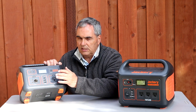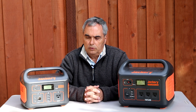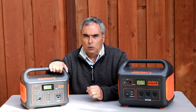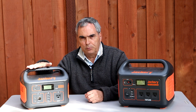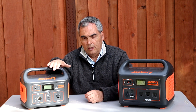The DC power ports are voltage regulated — the 10-amp port and the two 7-amp ports. When I say voltage regulated, I measured the voltage supplied from 100% capacity all the way down until the battery management system shut it off at less than 1% capacity remaining. Using about a 63-watt load, I was getting a voltage of 12.85 volts from 100% down to shutoff. So you'll get no voltage sag, and you won't have to worry about your equipment responding to voltage being too low as you run the power down to zero.